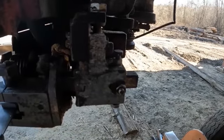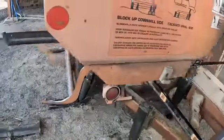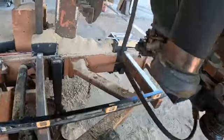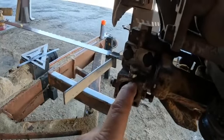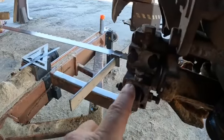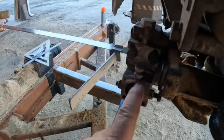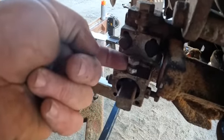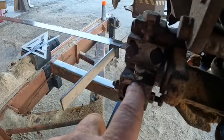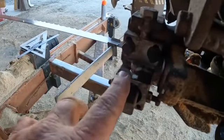It's kind of like cutting with a pocket knife — it's more dangerous to cut with a dull knife than a sharp one. With this saw blade, when you start having to force it because it is dull, that tells you you should have already changed that blade. If you change them a little more frequently than most people do, number one you'll get more sharpness which gives you more blade life. There's less stress put on that blade, less stress on your sawmill, less friction, less wear and tear on the entire operation. Your blade life goes up, your saw quality goes up, your maintenance goes down.